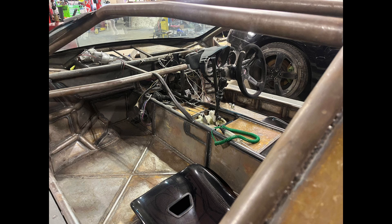Yeah, actually a big part of this that you can't even see is the fuel tank — it's actually inside the center console. It was about the safest place we could put it while also moving a lot of the weight forward in the car. We made it out of 065 stainless steel, so we don't have to line it if I decide to run E85, like you'd have to do if you did an aluminum cell or something. And also, since it's so long, we had to put diagonal baffling in it so it doesn't slosh heavy on acceleration or decel.